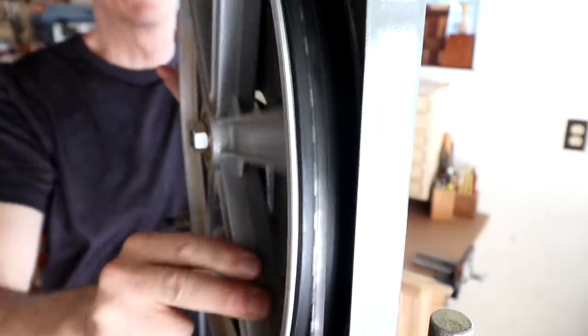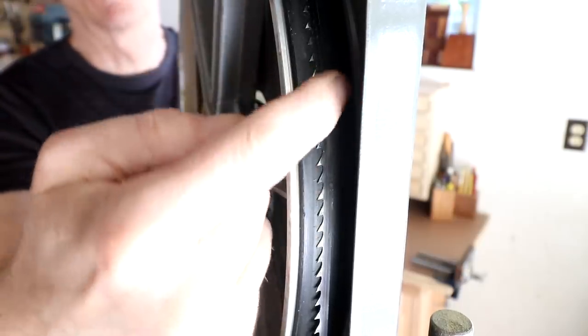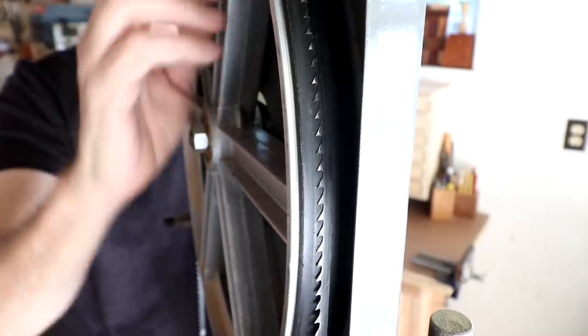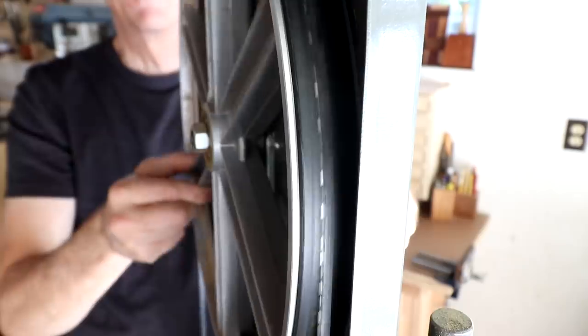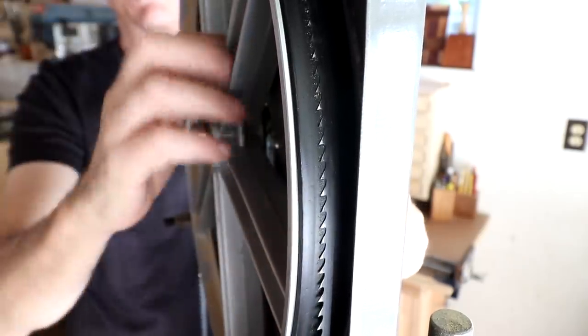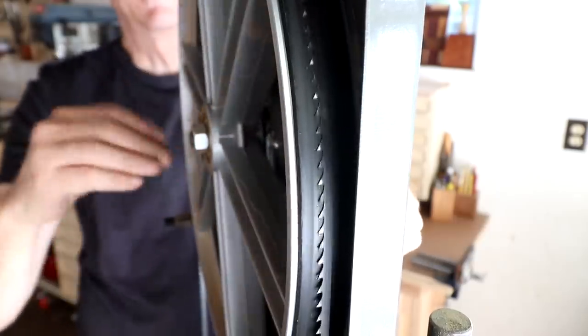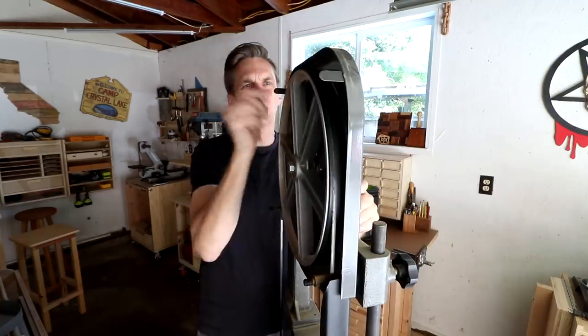With that fairly well tensioned, now I can just start to spin this wheel around. The whole name of the game here is you want to get the blade right in the center — the crown of the tire of the wheel. The tire is slightly curved on top and that's what helps keep it centered. I'm going to adjust this tracking and you'll see what goes. I turn this tracking knob and you see how the wheel comes in and out. If the blade seems like it's too close to the front, you can just tip the blade backwards a little bit. Just play with it and you'll figure it out — it takes a lot of fussing. I'm looking for it to stay pretty centered through lots of rotations, and it takes real small adjustments on that tracking to move the blade forward and backward.